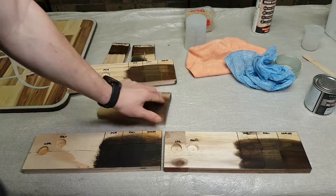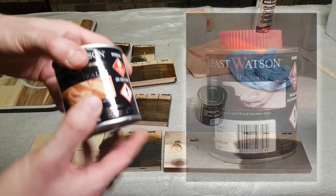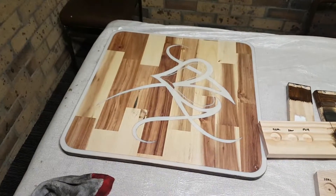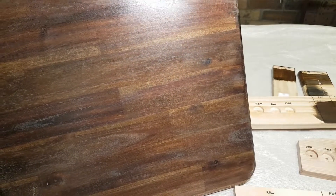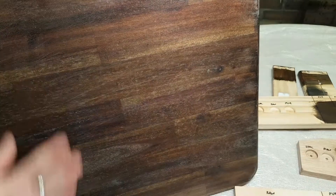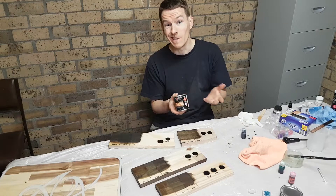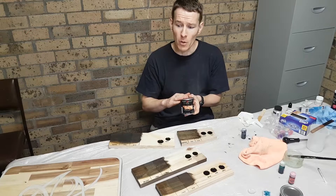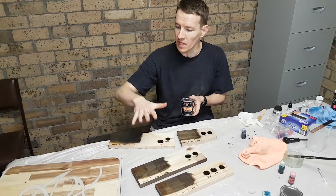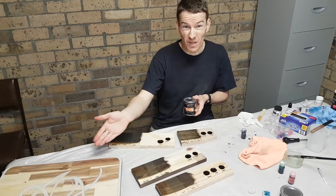So at the end of the day, this is the product we were looking at — the Feast Watson sanding sealer — and the stain and varnish and the proof tint were put over the top. This is the project, still being worked on, and on the back that's one coat of the stain and varnish after having applied sanding sealer. She's a little bit dusty and needs another coat or two, but it is looking really really nice considering what the wood looked like before — very very uneven coloring. Am I going to keep using this in the future? Probably. I'll buy it in a bigger tin too for better value, and I'm going to investigate other brands. I'm very happy I used it on the client's project. As for the PVA experiment, on a showpiece you wouldn't bother.